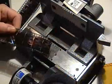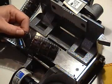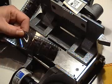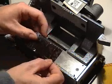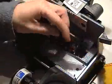Now we'll show you how to make a join. First of all, we've got to cut our piece of film. The joiner, if it's properly set up, will cut it correctly so that you do get a very slight overlap. Some people like doing what's called a butt join, where the edges butt up together — it's down to individual preference. When you put the film in the joiner, you need to make sure that you do cut it on a racking line, and then simply cut off like that.